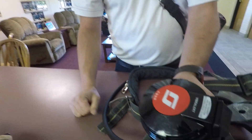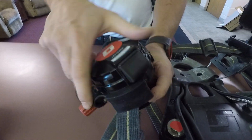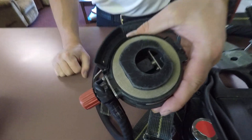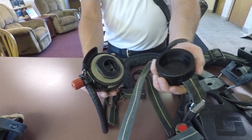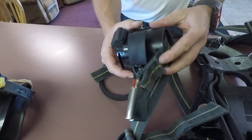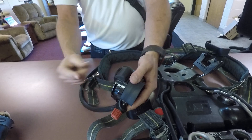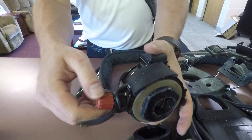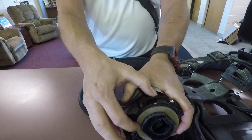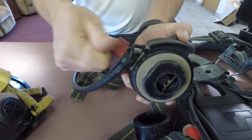Here is your second stage regulator. Nothing locks it in — just this turn pulls it out. Inside here is what you're breathing through. On the scene, make sure the cover is in place to protect you from breathing in anything that gets inside. It should not be hanging loose. On here is an air saver switch and a purge valve. The purge valve blows air up through here into your mask across the front of the mask.